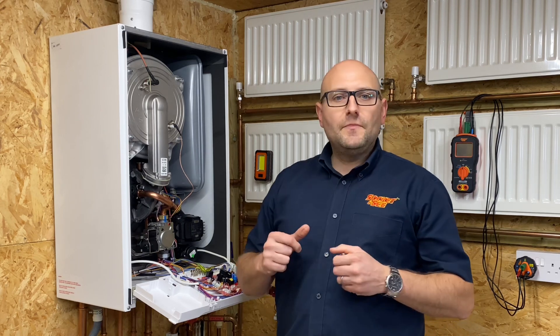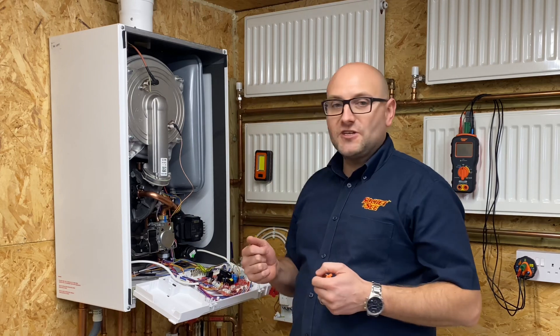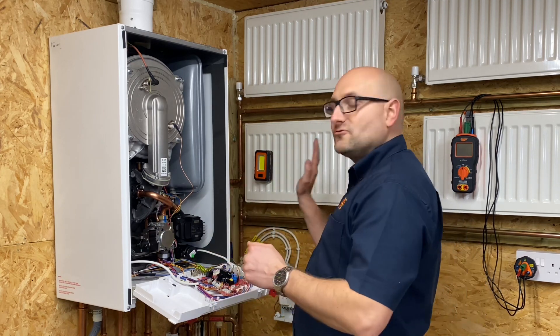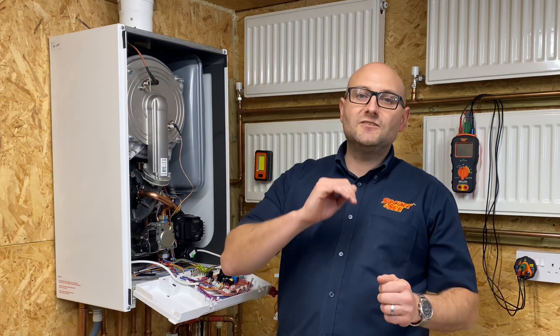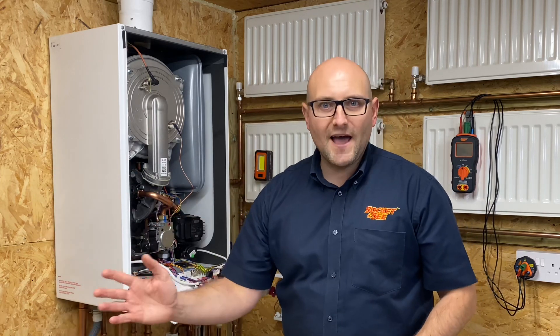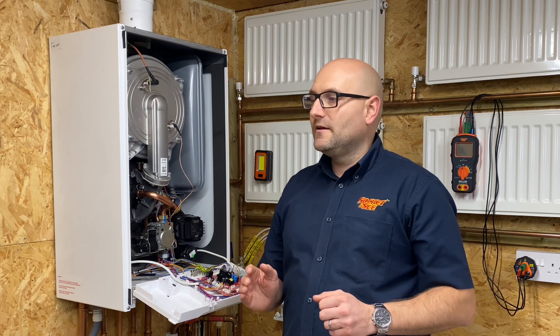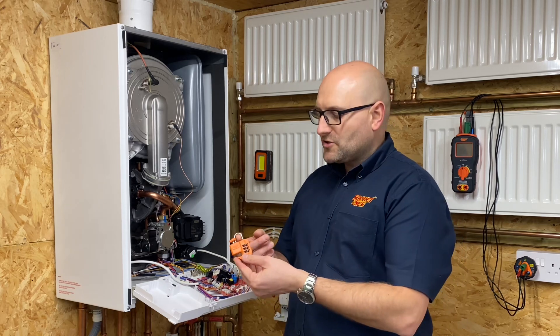On the topic of safe isolation, there was a great comment from Sid Waynehouse asking: what's the point in doing your safe isolation procedure if you're not going to lock off the fuse spur or other means of isolation? Absolutely brilliant point. I simply retained the fuse while safe isolating as I knew I wasn't going to leave the area. But if there was any chance I needed to pop to the toilet, fetch tools from the van, or go for lunch, I'd lock off the means of isolation — whether it's a fuse spur, plug top, or MCB at the consumer unit — and put a sign up saying do not re-energize.